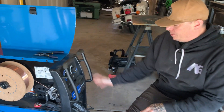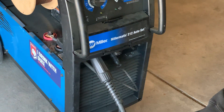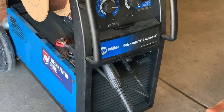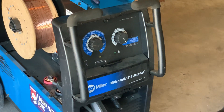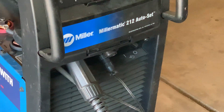That moves us to the front of the machine. This is our control cable — another industry slang for this is a pigtail, which is what most people call it. What this does is connect our cable and gun to the machine and to the trigger. We have to have this connected so that when we hit the trigger on our gun, our wire speed and everything we've set on the machine transfers and goes into that gun.